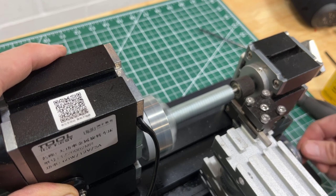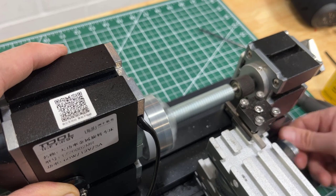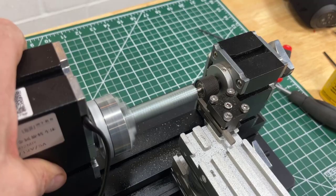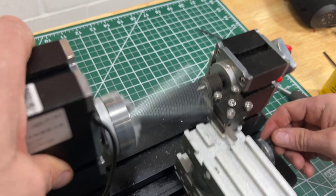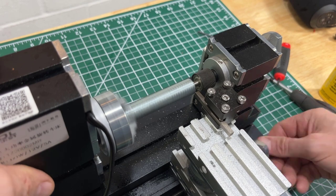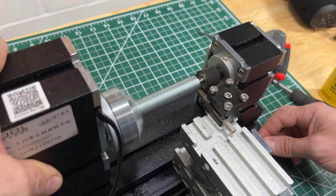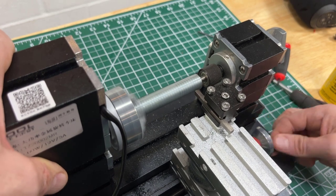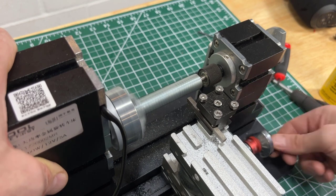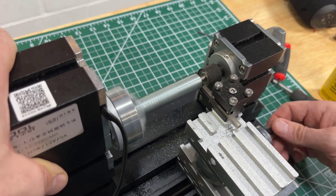If you're working on really soft metals — copper, aluminum — maybe this will be fine. I actually worked on steel that was zinc-coated and I struggled. It just wasn't working well. My cutting edge was dulling, so I know I was trying to do something on this machine that it really wasn't intended for. That's on me, and maybe my lack of skill working with these machines made my experience not as good as it could have been.